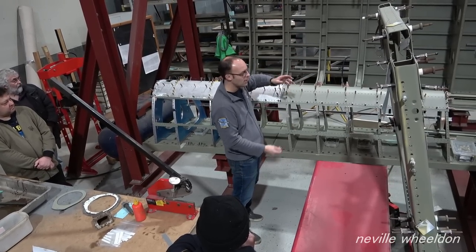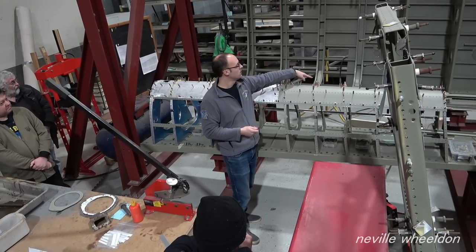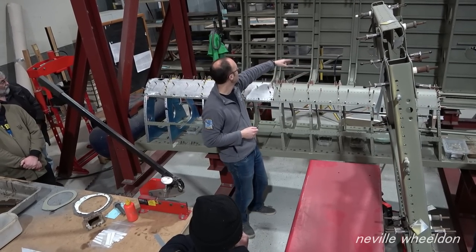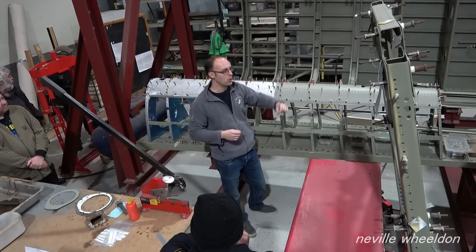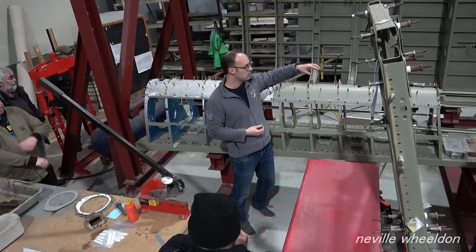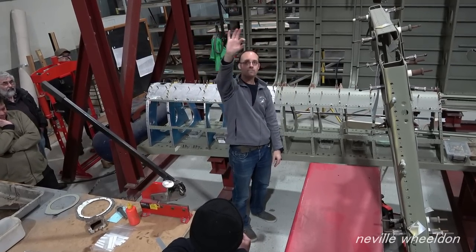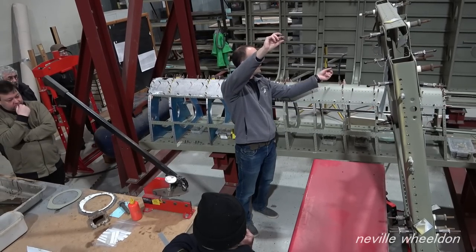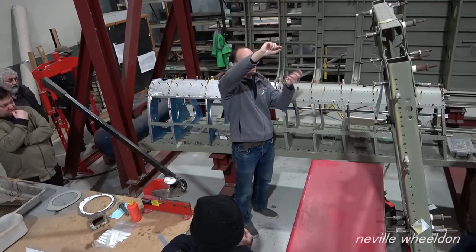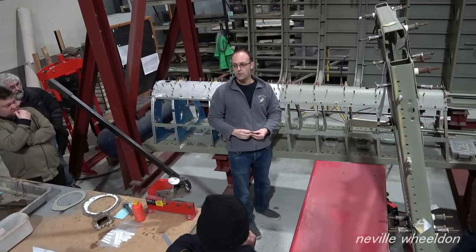The wing consists of two sections: the main plane and the trailing edge. The trailing edge holds the aileron and the flap, and comes from effectively the bottom of that wing down to a taper. The trailing edge for this wing is on the next jig over — though right now it just looks like two big booms and some boxes of bits because it's in component parts. The trailing edge attaches to the main spar by a special double-ended stud: the long end goes through the spar with a nut, and the shorter end goes through the trailing edge spar with a nut.